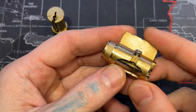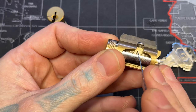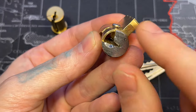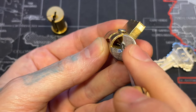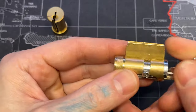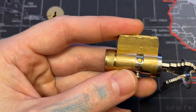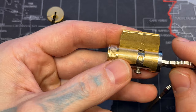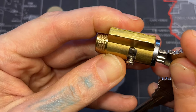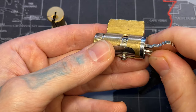A couple of things to note when you make it. This little bolt right here — I had to drill and tap a hole. I recommend doing a slightly smaller hole and a thinner slot. That's to prevent this from overturning and dropping the driver pins into the hole area. Also, drill it the minimum amount you need to. You can see how this pin's exposed when I turn it, so that pin can fall out — and it's already happened to me. Make it offset from the pin so your pins won't fall out if your lock turns this way.